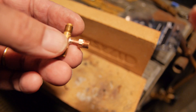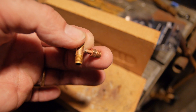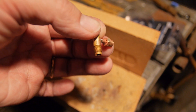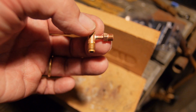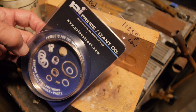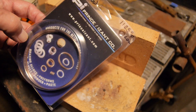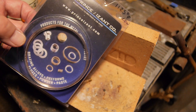The joint you can see on this T-piece has already been silver soldered. I didn't plan to put this new joint in so close — it would have been nice to do the two at the same time. But I'm going to do this new joint with a lower temperature silver solder so it won't affect the existing joint. I'm using a low temperature silver solder with a melting point of 1125 degrees Fahrenheit, which gives me the possibility of not melting other joints while silver soldering this one.